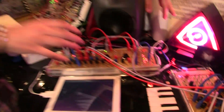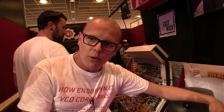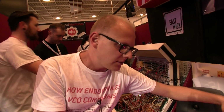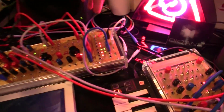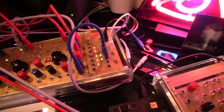And there are some small internal generators, which you can control with a CC control over MIDI, and you can make small LFOs: triangles, sines, saw, square, and so on, and a bit of noise, and some random fluctuating voltages. We have that here too. It's not only a USB CV module. It's also a power supply.